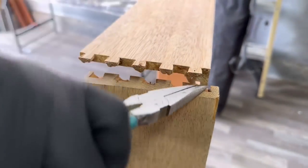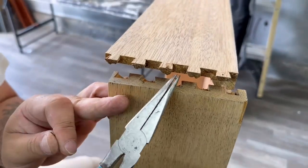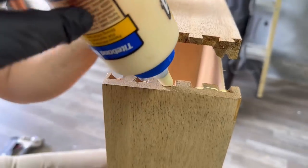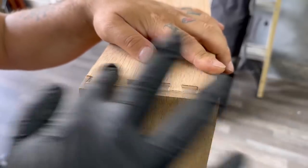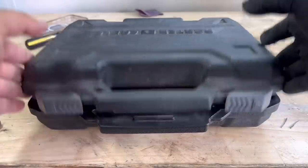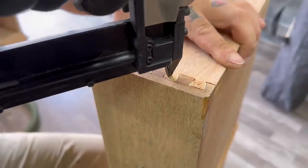This is a very common repair that a lot of vintage dressers run into — the dovetail joinery tends to dry out and the glue tends to come apart. I'm just going to be re-gluing this, and instead of clamping it, what I like to do is use my pin nailer just to hold it in place so that way it has time to dry and I don't have to use a big clamp.